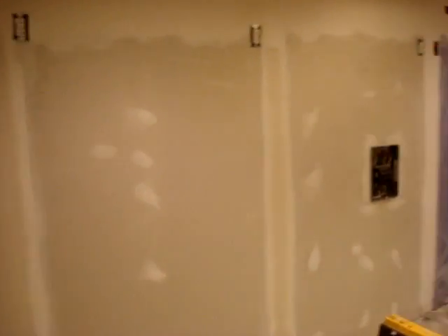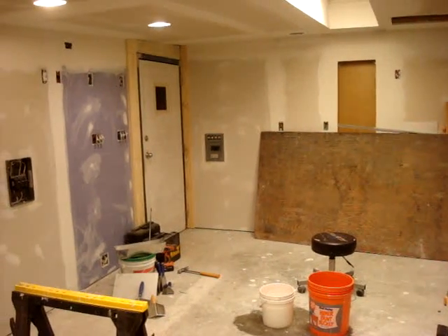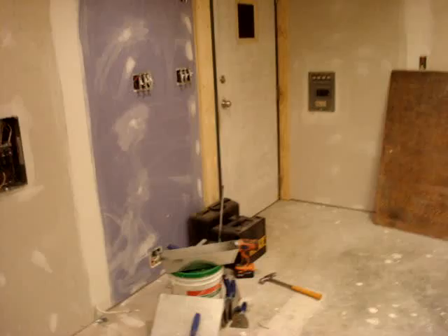I work from home because I babysit Simon, my 17-month-old — Linda and I haven't done daycare. The drywall I'm finishing today is 5/8 inch fire-rated Type X, though it didn't have to be; I just wanted it for acoustic control. This is joint compound I just put down, and if it looks pretty smooth, it's because I hate sanding. I've learned to apply it in such a way that I really don't have to sand very much. Ultimately I'll do a level 5 finish in here, so there'll be no tool marks or anything.